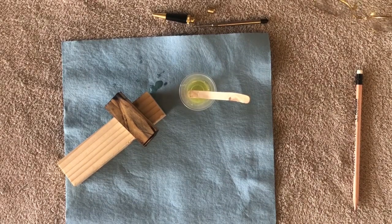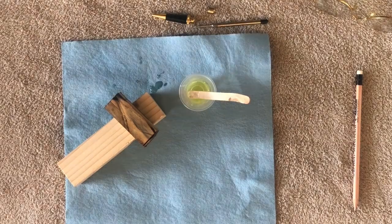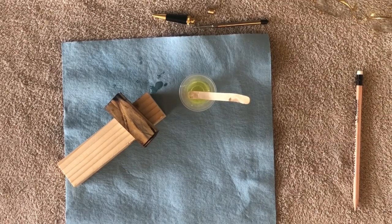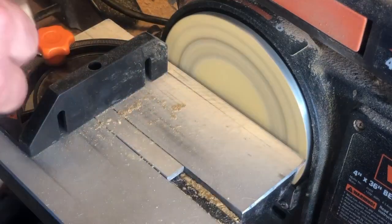You'll see the epoxy will turn yellow and then a little darker yellow. And if you leave it there a long time, it'll really turn an orangish color. And you can feel the cup, it'll heat up. Once it's really cooking, it's really hard to hold your hand on it. Wait till it cools down, wait till it turns a little darker yellow. Then you're assured that the tube in the blank is set and you're ready to go with it. Otherwise, just keep it there a little longer.